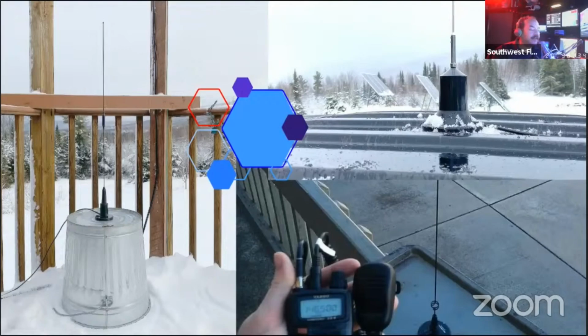I can tell you this: the counterpoise is just as important as the antenna. If you don't have one, the other's not going to perform. When I do my ground plane with my mag mount up at the cabin, I have a spot where I put an alligator clip on the pan, and that way I make sure it's grounding, that it's an actual ground plane. See, when you put it on your vehicle and stick it on the roof, your radio's grounded.